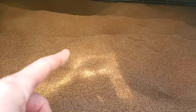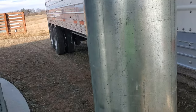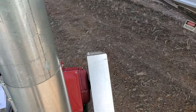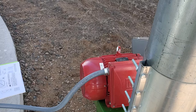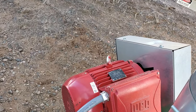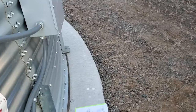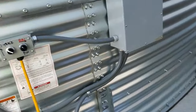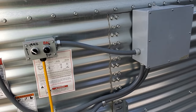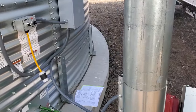The auger goes into the floor, under the floor in the bin, as well as a vertical unload auger that dumps into the truck. I called the electrician. He came out last night, then came out first thing this morning, took the motor off, had it tested. Apparently water got in it somehow — not through any ordinary route — and it froze around the shaft. These things are supposed to be weatherproof, and this has never been run other than 10 seconds when they first hooked up the wiring. The location of the switches and the documentation wasn't clear, so I had the electrician, with suggestions from the trucker, come up with a user-friendly design.